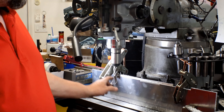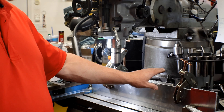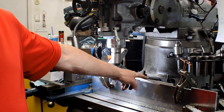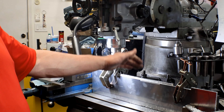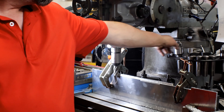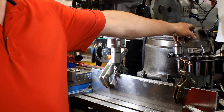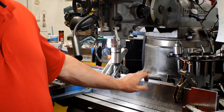End mills do a lot better cutting from the side. I squared the head — I had it tilted over — and I squared it using those same five-eighths T-slot parallels, running the indicator across to confirm the head was square. The zero mark on the column is very accurate; all the angles are etched on it.